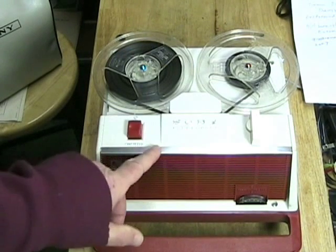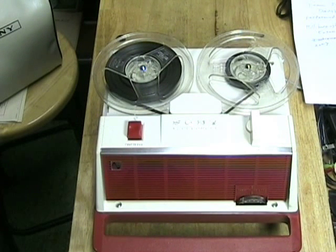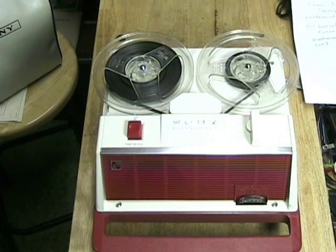It was pretty simple to do because the board is fully accessible. This long line here is the record/play switch, which runs the entire length of the amplifier board and is very difficult to clean, but you can get in there with a cleaning solution with a straw and spray it. That is how you replace the tubes in this tape recorder. Thank you for watching this video on the Sony TC-135, made approximately 1965. I hope you enjoyed the video — please keep watching Clydeside Channel for more vintage audio tape recorder videos.